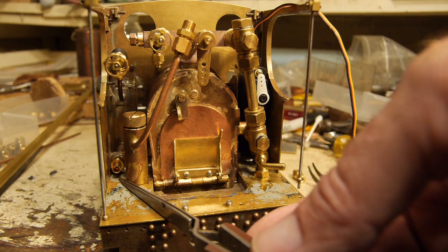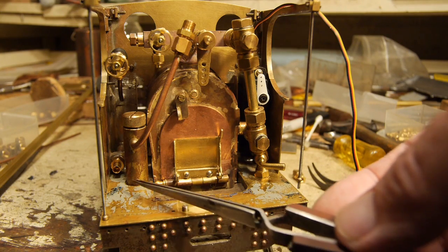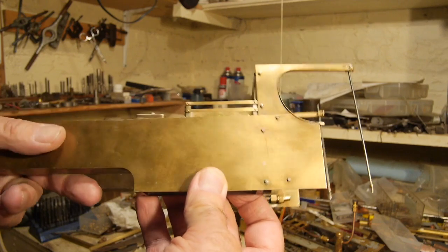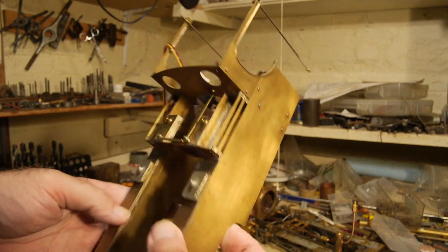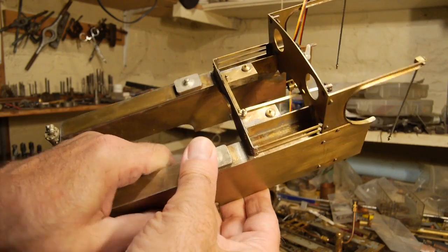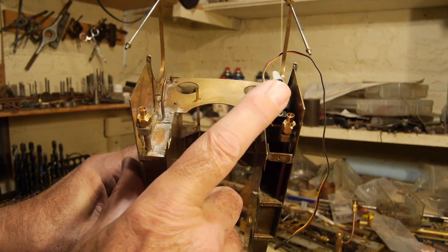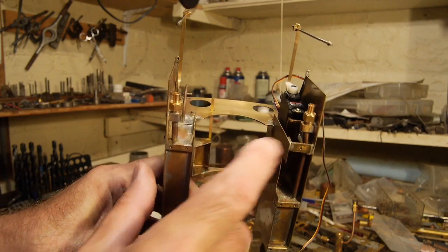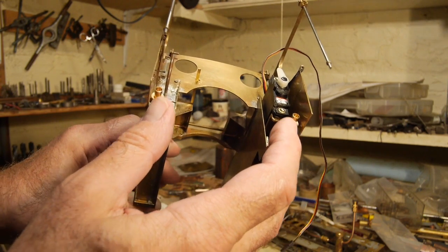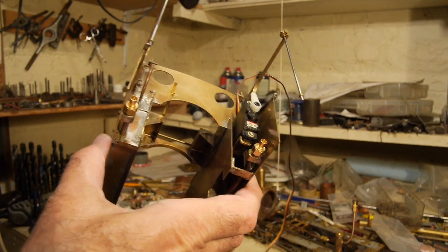What I have here — you can see in this corner — there's a pipe outlet, and I have a similar one on the other side at the bottom of the side tanks. These two outlets need to be connected together. Here's the side tank assembly for Russell. You can see it all comes together in one lot; it took quite a long time to make this out of brass and angle. That's the servo motor there for the throttle or regulator, and these are the outlet pipes at the bottom. The problem is they're buried once I put this onto the chassis, so I have to extend them out of the area of the firebox so I can make connections to them.